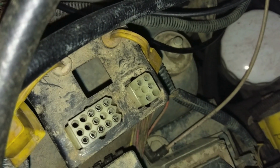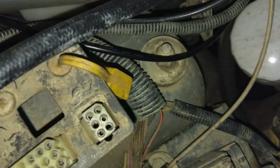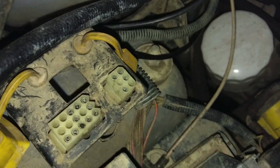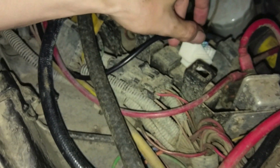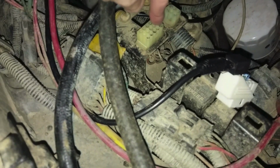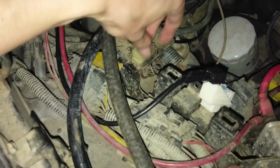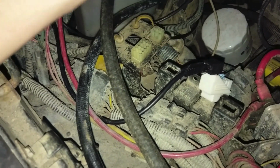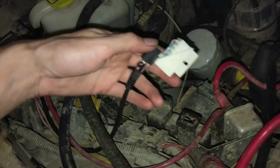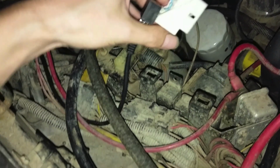If you have these on your Jeep or other Renix era vehicle, then you're in the money. If you notice, they're not all filled in, as they're not all useful. A lot of them have to do with ABS and things like that, and trans. But the first thing you've got to decide is how you want to interface with it. You can just take bare wire, fold it in half and stick it in there if you just want to do some quick testing, and that works great. But if you ever mess up and the wires slip, you might short something out, and I blew up a transistor once doing that. So yeah, it's time to go up to the big boy toys.